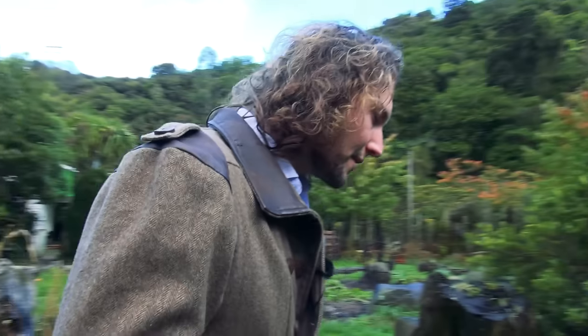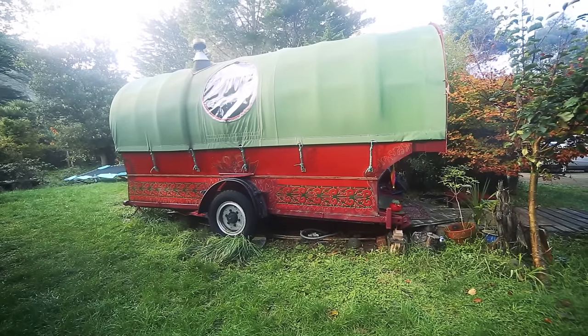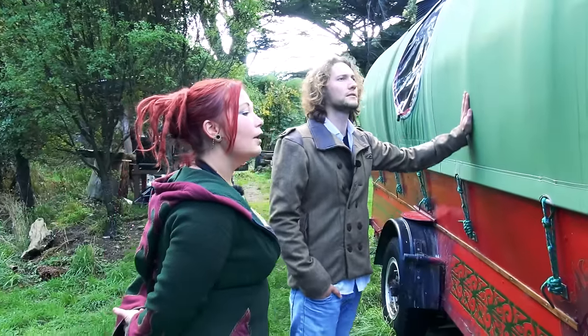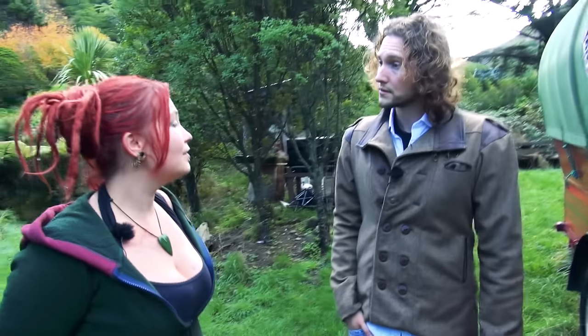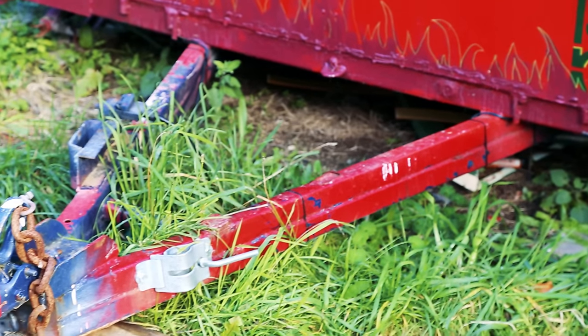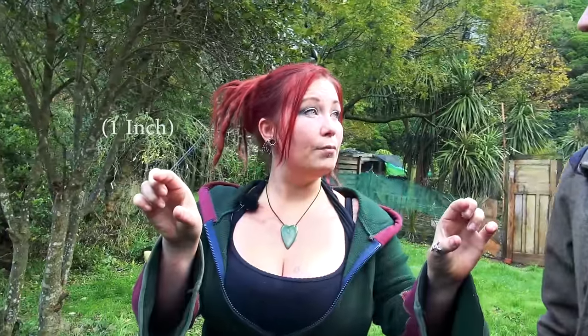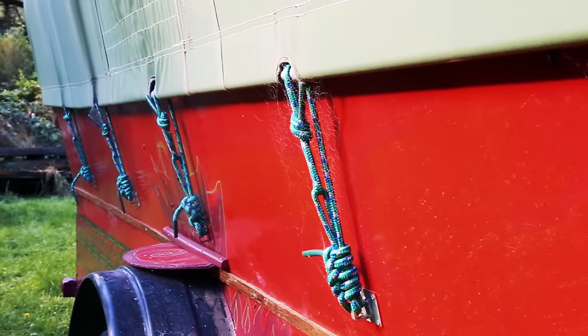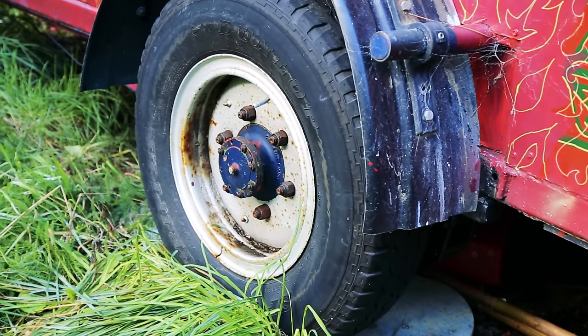So what's it actually made from? It's kind of based on a traditional bow top with the canvas, but it's a bit away from the traditional sense because it's got a MIG welded steel frame as the interior. I built the steel frame onto the trailer, and then it's got plywood on the outside. It's 25mil box section through the middle, and in between the box section there's 25mil polystyrene and then ply on the inside, so it's fully insulated all through the walls. The whole thing weighs a ton and a half with all my stuff in it. You need a decent sized truck to pull it, but it is pullable.